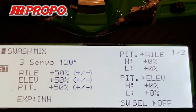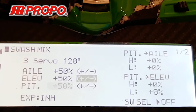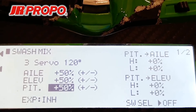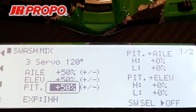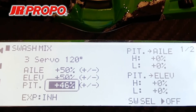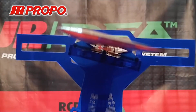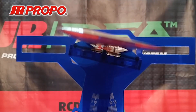Back to my T-44, I'm going to scroll down to the pitch setting, which is the positive 50% that we were using when we did the calibration. I'm going to highlight the positive 50, click it, and start scrolling down. This will reduce the overall collective pitch range and reduce it evenly in both positive and negative directions. As I scroll the percentage down, I'm going to watch the top of the pitch gauge — you'll notice that it's moving towards level.